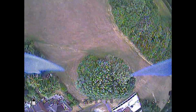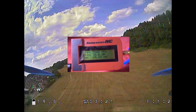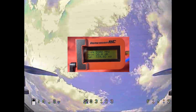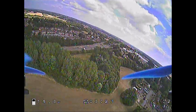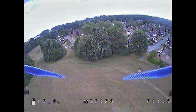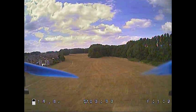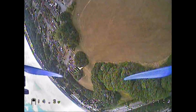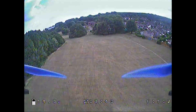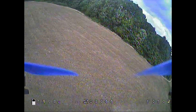As for the VTX, 25 milliwatt is closer to 10 milliwatt in practice, and 600 milliwatt is only showing around 320 milliwatt according to the immersion power meter, so make of that what you will. And that's my take on the SpeedyBee VTX and DVR combo. I'll link it below — as always thanks so much for watching, please continue to subscribe. Cheers!